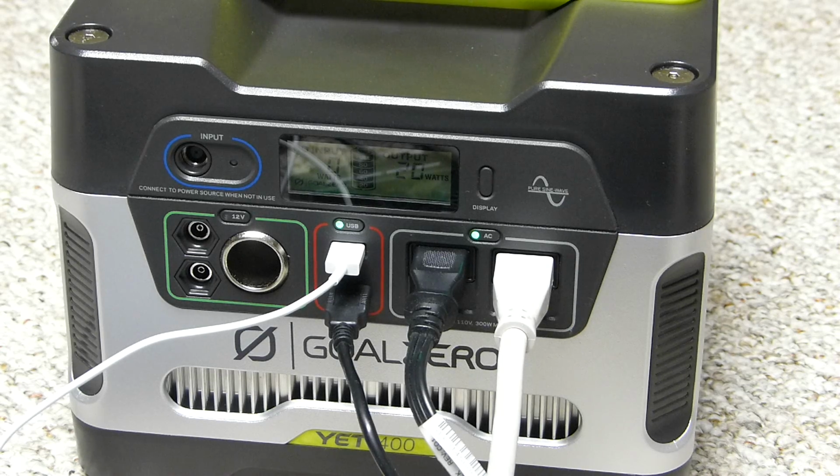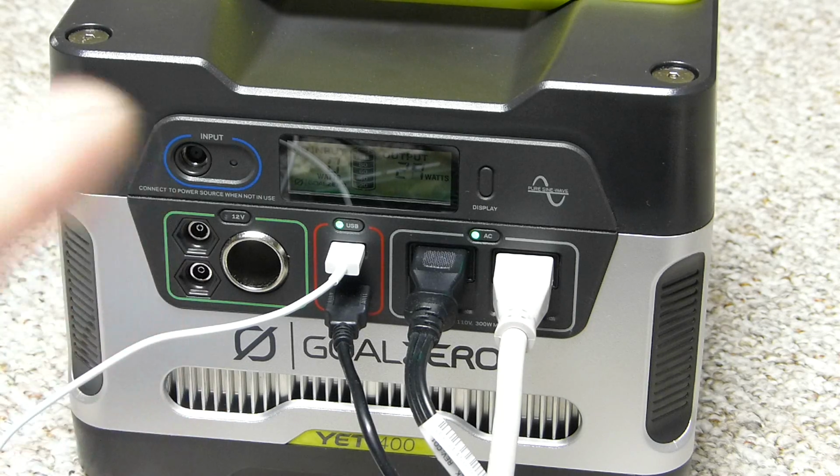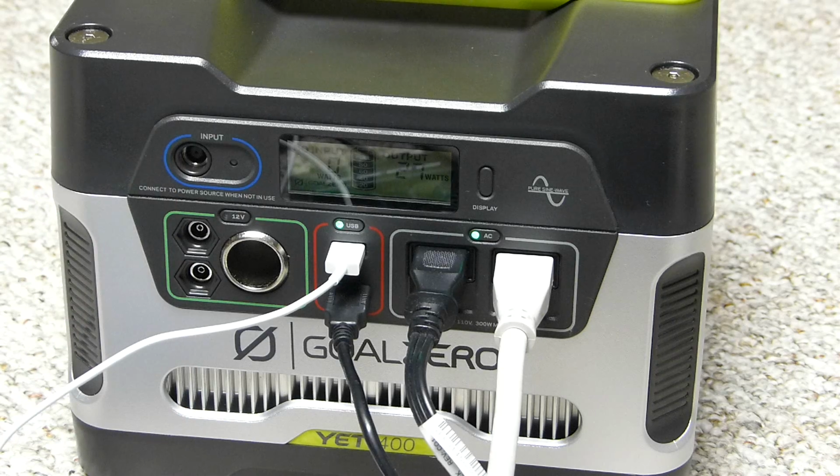And from the solar panel, the maximum input is 120 watts. So if you plug it right into the blue 8mm adapter, the same one that you plug into the wall. I'm not sure why that's 120 watts, whereas the charge coming from the wall is rated at 72 watts. It might have something to do with the onboard regulator or the charge controller. So if it uses more, it'll step it down, is my understanding.